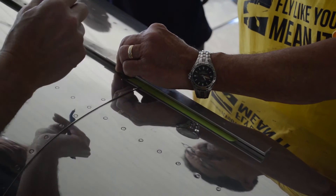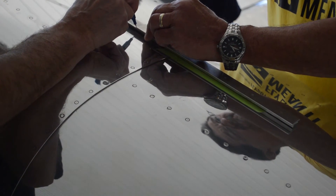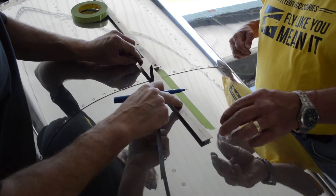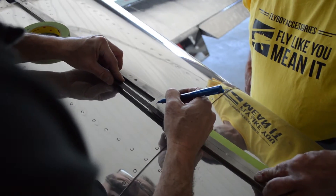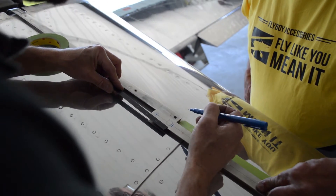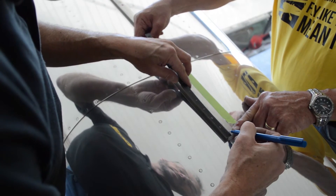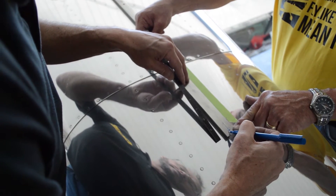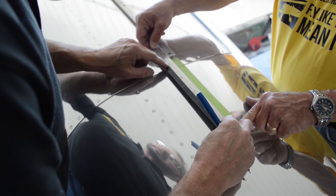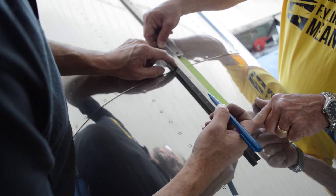Take a moment to examine your existing spine track and plan where to place fasteners. The extension piece is designed to overlap with the existing track for strength and function, but the extent of the overlap and the method of installation is ultimately up to you. In this install, we're using the extension piece as is with the full 2 inches of overlap. This will get us two screws in the front of the track extension, one of which was match drilled to the original track screw, and for the rest of the track we found a sensible spacing for the remaining screws.